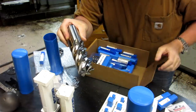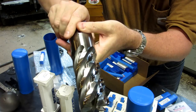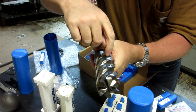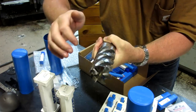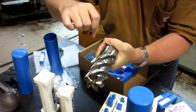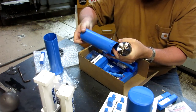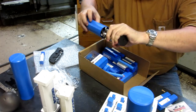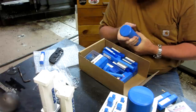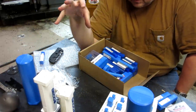Again, looking at a cutter like this, it really makes you think about the tooling and the machines that go into grinding a cutter like this. It would be fascinating. You can kind of tell by looking at the tool path that they took a regular end mill with regular straight flutes and cut this crest cut style. I don't know what Niagara refers to this as. Let's see if there's anything in the package. Nothing. The crest cut has the same effect as a rougher in that it lengthens the effective cutting edge for the same size cut, so it reduces your cutting forces.